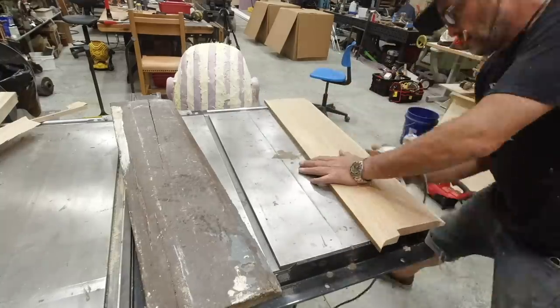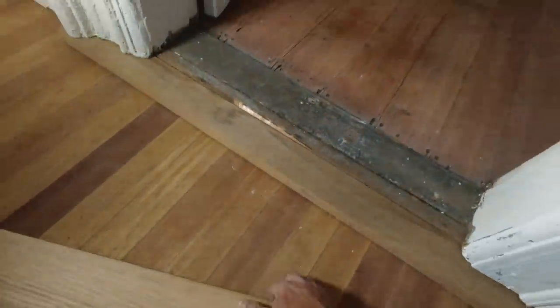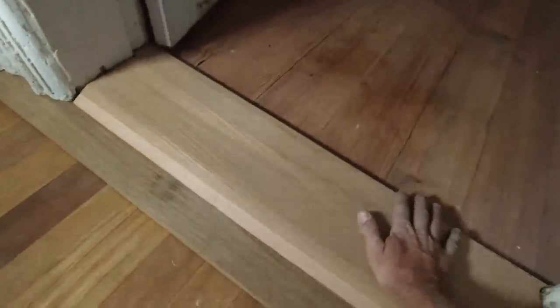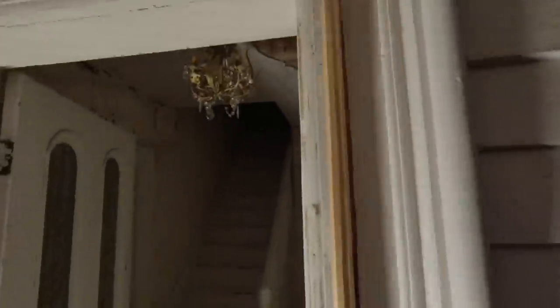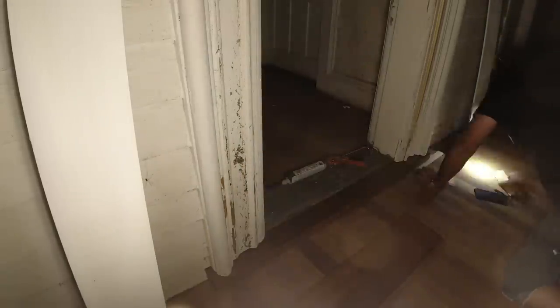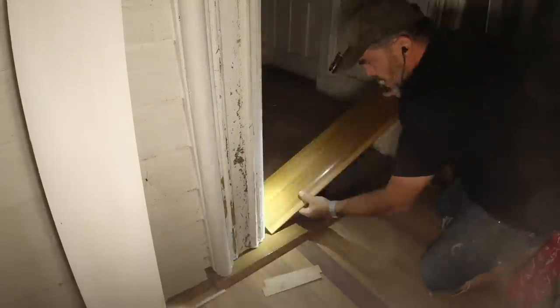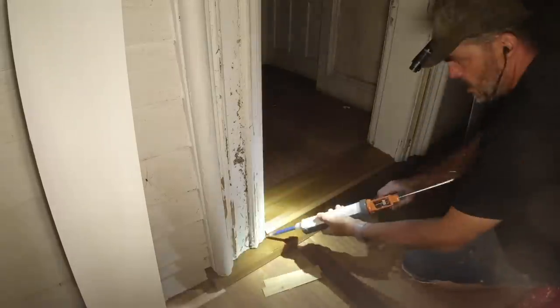I'm giving it a little palm sand — I had to add a small piece to it. On my front porch there was a big empty gap; that piece of oak fills in the gap underneath both sides of the crown molding. Since I've owned this house those gaps have been under the door molding, and now I have it all fit so it will come together nicely. I use epoxy from Total Boat — the Thickso. There's the piece of molding I made to replace the missing one, using the router and table saw to mimic the profile. I put a small ledge in front of the threshold so it doesn't kiss the top of the deck, raising it up just a little bit, which looks nicer.